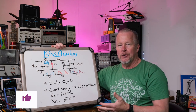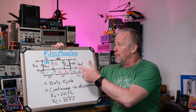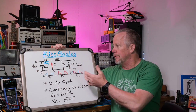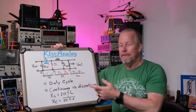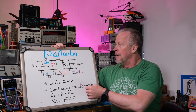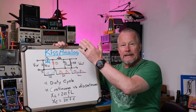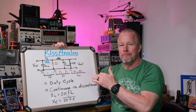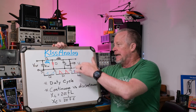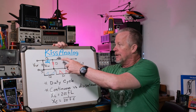We have this switch and we turn it on and off. It bucks — when it's open it blocks the input voltage; when it closes, let's say it's on half the time and off half the time, so the duty cycle is 50%. If you have 10 volts on the input you get five volts on the output — you get the average. If you had no inductor here, just a straight line, you'd have the voltage charging up to 10 volts and discharging down, and the average would be around five volts, but you'd have this huge ripple — unacceptable.